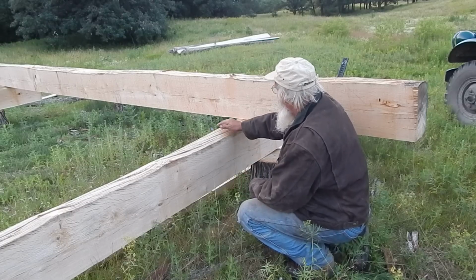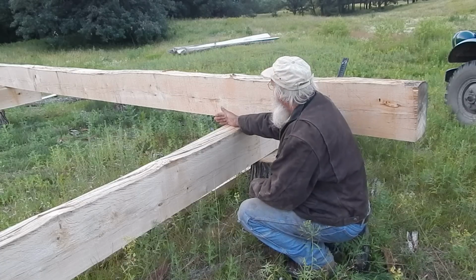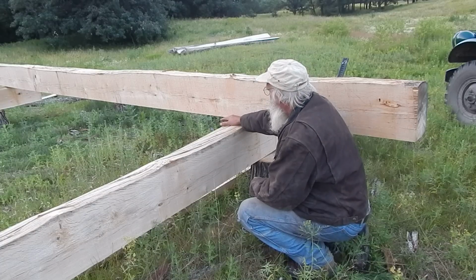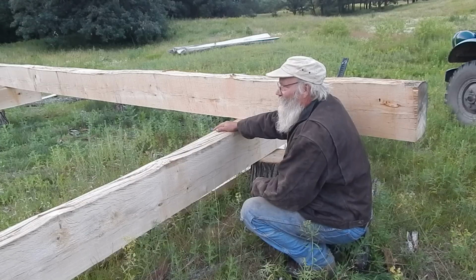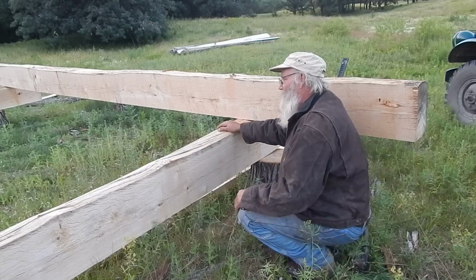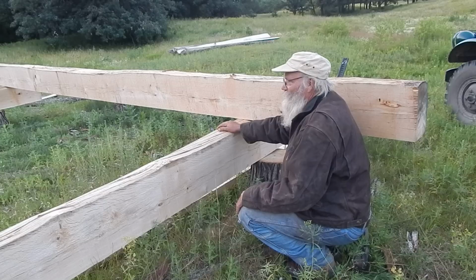But then the part of the stump, or the pillar there, that will be higher will line up to use for where the floor joists go, especially the two end ones. But I will be doing 4 on each side, and there'll be 3 on each end. So I'll be doing that, and then all the way across, really. But that's what's going to hold it up, is those 10 sunk into the ground on a pad of cement.